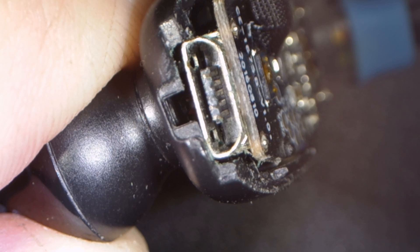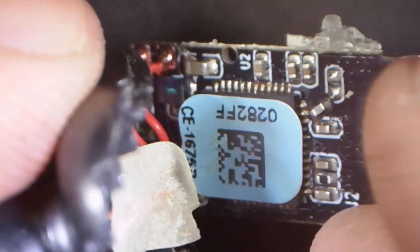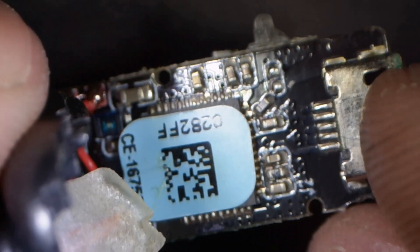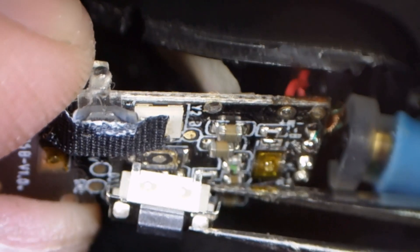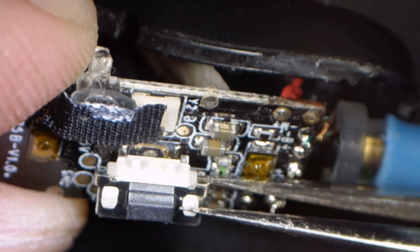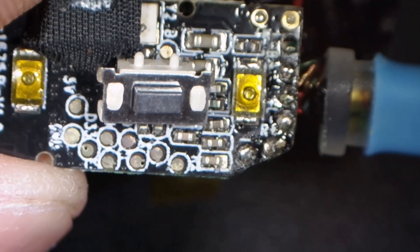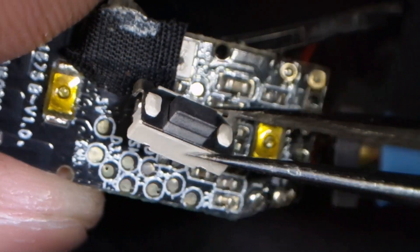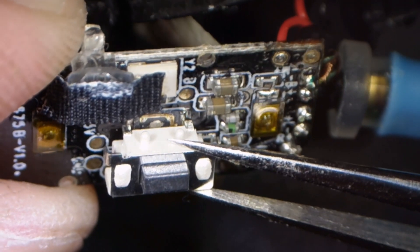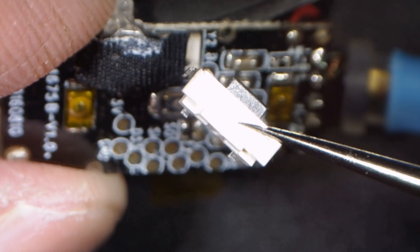We'll take a quick look at the charging port — as much use as it's had over the last four or five years, it actually looks really, really good. No corrosion on the board and the solder pads for the charging port look to be in very good condition. I just so happen to have some of these little cheap switches — not really meant for this exact purpose, meant to mount 90 degrees from this on the surface mount pad — but pin to pin it's going to be close enough to probably work. Even though this switch is super tiny it looks huge on this board. I had ordered these working on a buddy's GPS dog collars and had to order a pack of 10, so that's why I had some.